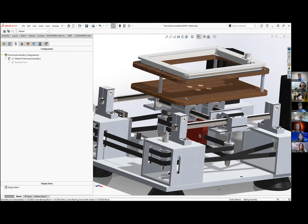For vertical motion specifically, the team intentionally left the pulleys free-floating so they would self-align. There is a slight height difference between the drive pulley and the corner pulleys, and by allowing them to move vertically up and down on the shaft, they all line up on the exact same plane, eliminating belt strain from being pulled in different directions. Regarding assembly time, the team estimated about 15 minutes for physical assembly, rising to approximately 51 minutes when including soldering time for the electrical interface.